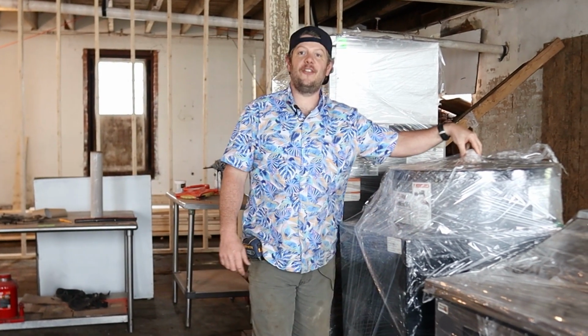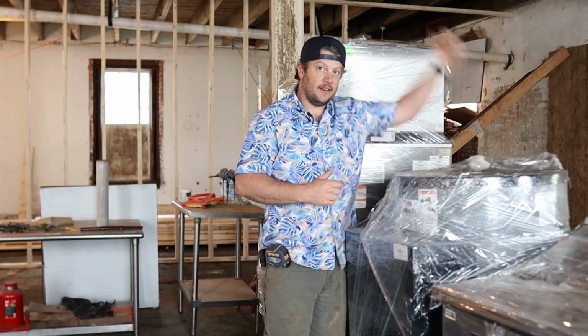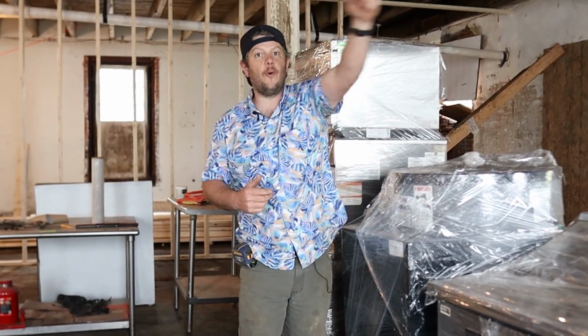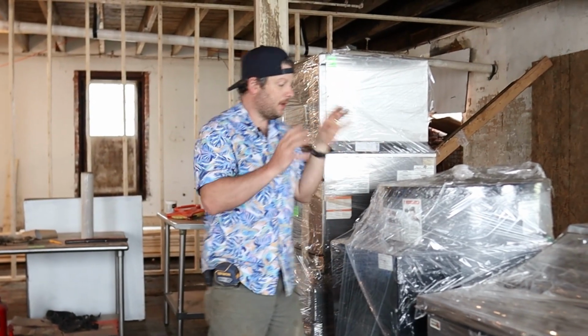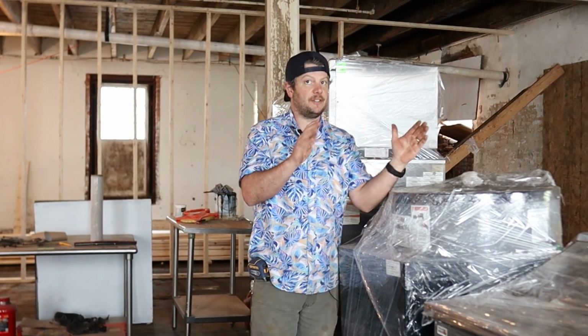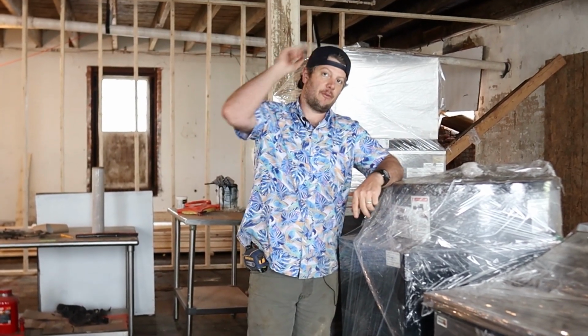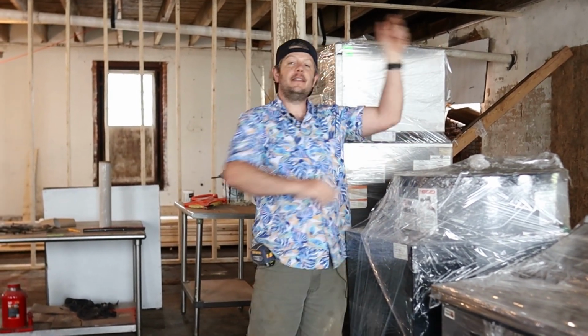This thing has a 1.5-inch output and 1.5-inch input. I'm gonna run this through a 2-inch recirculating loop, meaning the pipe will come out of here and go into a giant 300-foot loop of insulated 2-inch pipe, and there will be a recirculating pump. Where this is only 50 gallons, by the time you do the math on the loop, the length we need is another 50 gallons of water just in the pipes that will run through the building. And it'll run constantly.